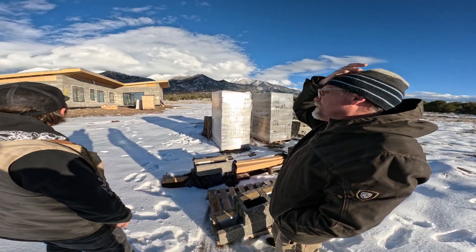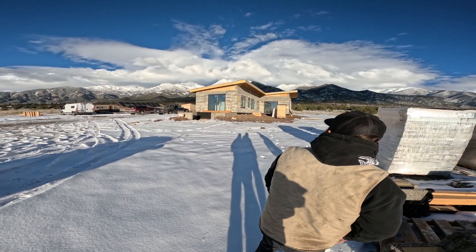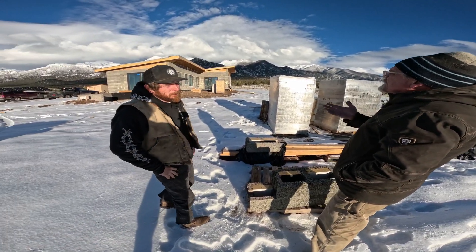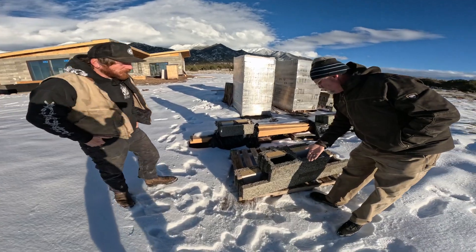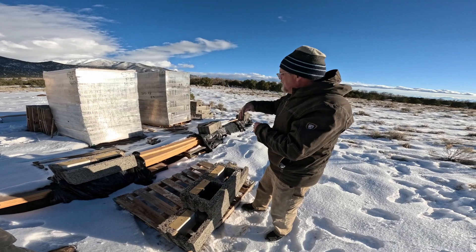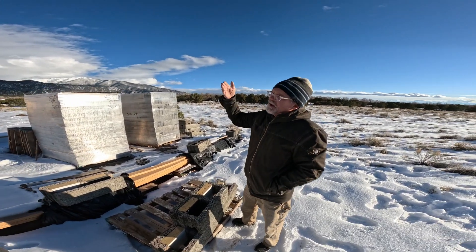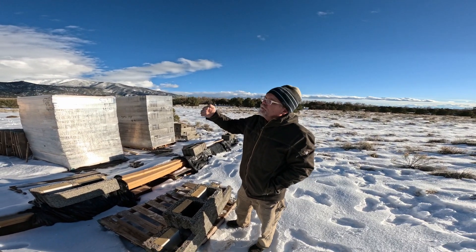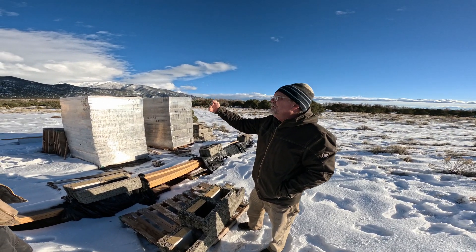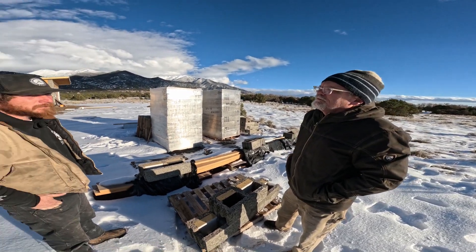We have big door openings that are eight feet — you have to do a little beam captured in that. The nice thing about this is you can cut these with just a circular saw. They come with different options — corner ones, ones designed to be split. They give you information about how to lay out your windows, with wall lengths and window openings sized to use the block efficiently.